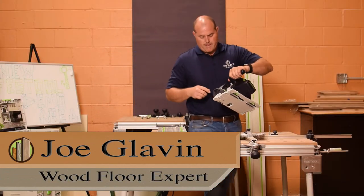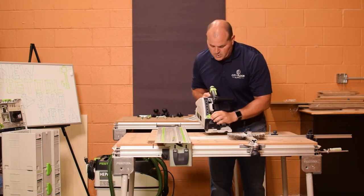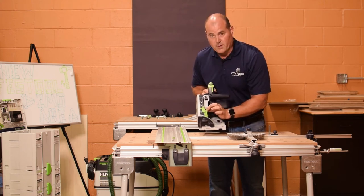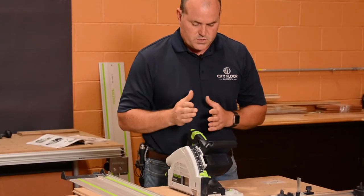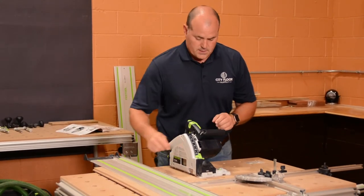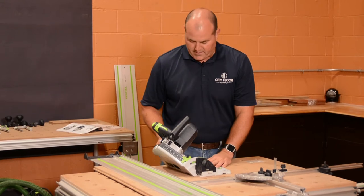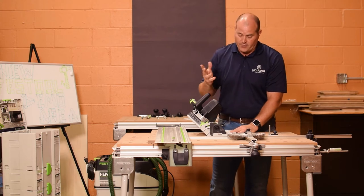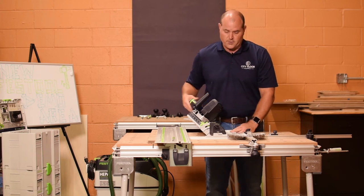On the micro adjust — right now this is a scale in metric, but it is also available in Imperial. You can adjust this just by pushing in there and also with a little bit of a micro adjust, which is a new feature for them on the TS55. This unit will tilt and cut on an angle up to 45 degrees. You can also do 22 and a half, 30 degrees, and you can even go below zero to a negative one degree, which is another new feature.